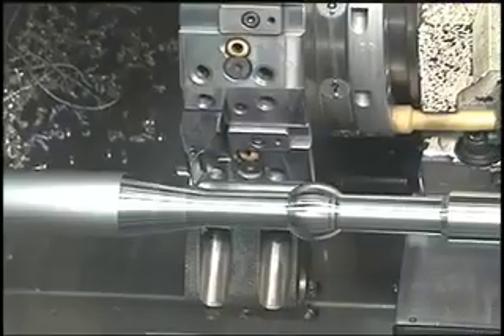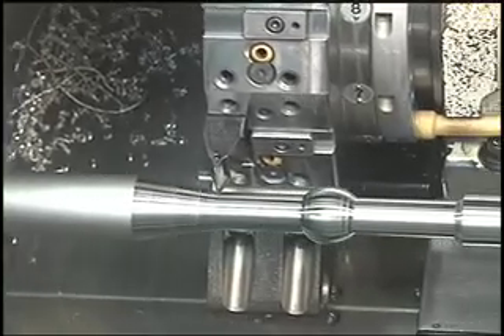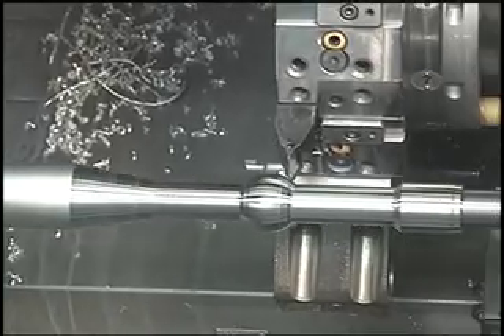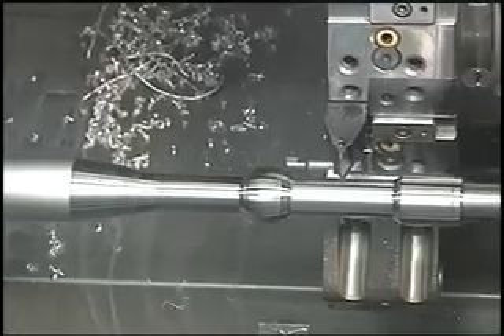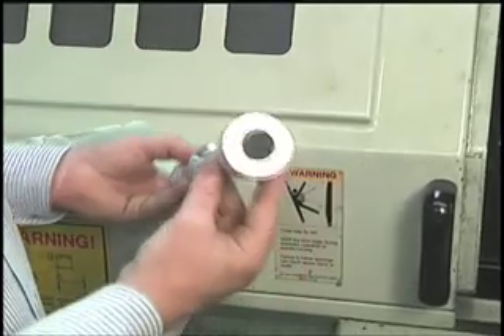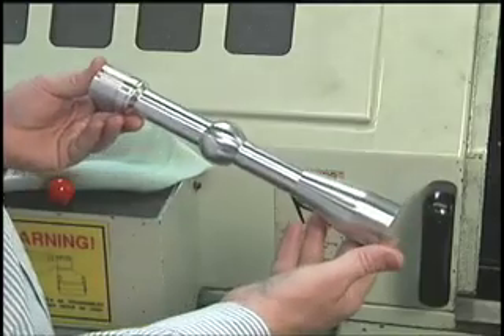That's why Burris makes a major investment in the design and manufacture of the outer tube. Uniquely, Burris starts with a large solid extrusion that looks just like this. Roughly 75 to 90 percent of the raw bar stock is removed when making a Burris outer tube. The result is a true one-piece outer tube with no joints that can fail or leak. And unlike most others, the material has not been bent or stretched, creating stress fractures.